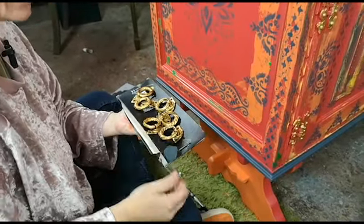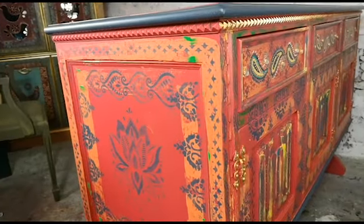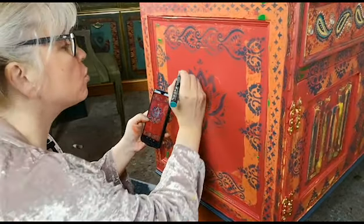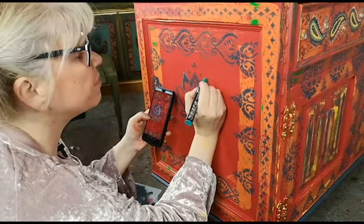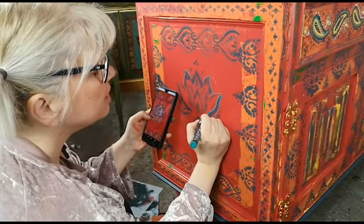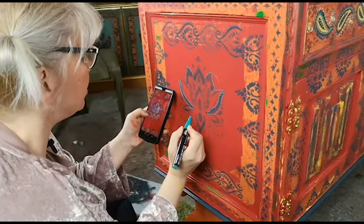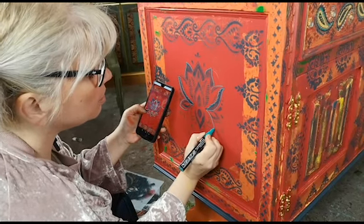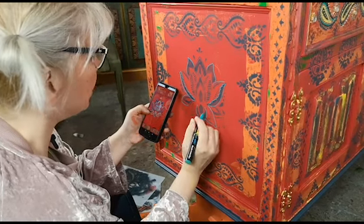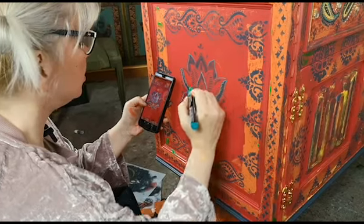In the spirit of not spending money, I normally put new handles on pieces, but with these I've just painted them in gold. This section up here is gold as well, following from this line, and this is gold too. Now, I just had my gold Gilding paint and a tiny little artist brush, and all I did was paint one coat along the carved details — in general I'd give it two coats, but we're going for a distressed sort of look. Then I got the gold and just ran it into corners and edges where I wanted a little highlight.